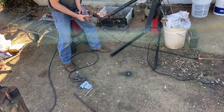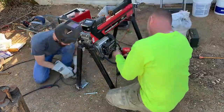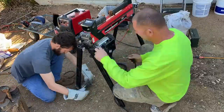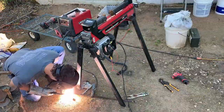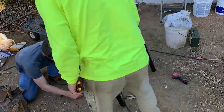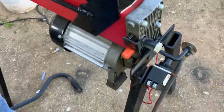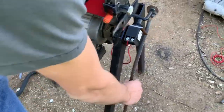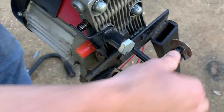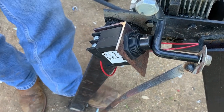Now we're gonna make some damn messes. We just finished up relocating that switch and adding that foot lever, so the top works exactly the same. The way you actuate those is different though — we started with this foot pedal using this little door hinge. This base has a little bit of linkage going up here, just an old piece of rebar with some washers on the end of it to grab this hydraulic lever. You step on the pedal, it grabs that hydraulic lever, then we have the button pushed on the end of this handle, so when you step on that foot switch it activates everything.